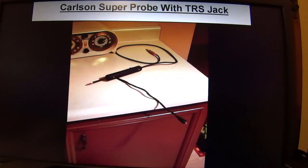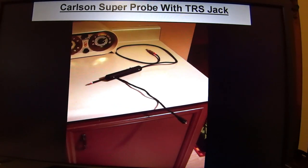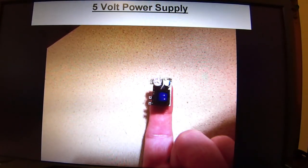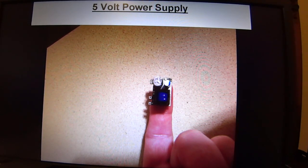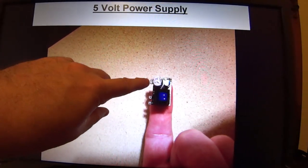Here's a picture of the probe I built — you'll notice it has a TRS connector on the end. It was all built through-hole, not with smaller surface mount components, but it worked for me on a prototype board and it all sits inside this copper pipe. Here's a picture of the 5-volt power supply that I put inside the ICO — it's quite small, fits on your fingers, with a 110/120-volt input and a 5-volt output.